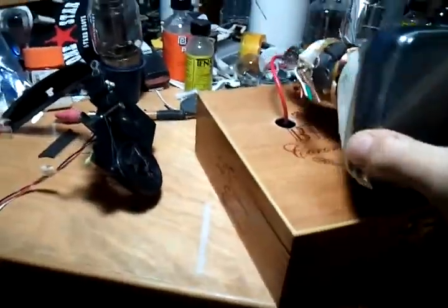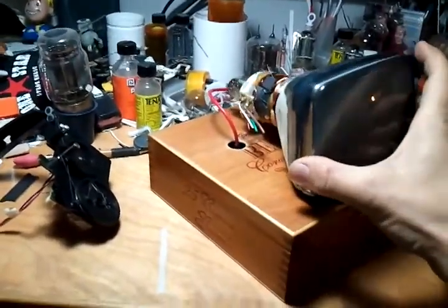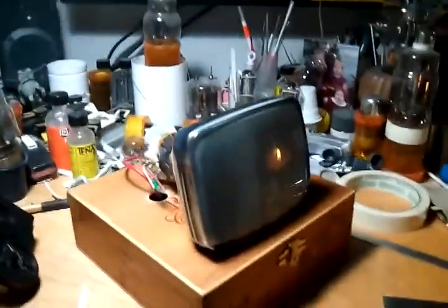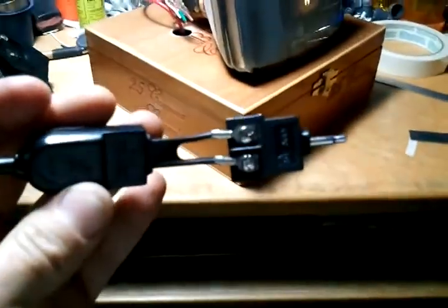I got a project here. I got a little 5-inch black and white TV, this little portable TV — you plug it in, take it wherever you go, plug it into the car, run it on batteries, or just plug it in at home. It's black and white, didn't have any video or audio inputs, all it had was antenna. I was able to use a Balun connector to jump to a coaxial connector, and then that can go into DVD or VHS. I already had this hooked up last night — I was watching the X-Files: Fight the Future, which I had left in the VCR from probably about 10 years ago.